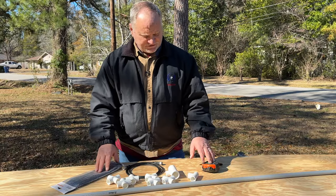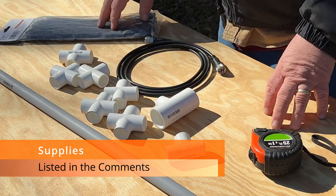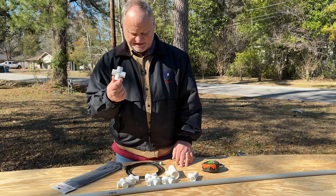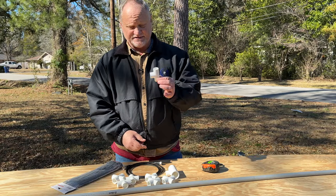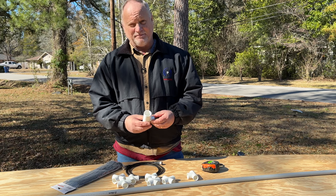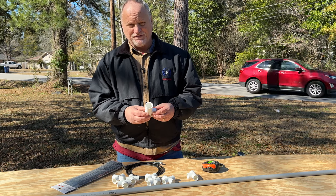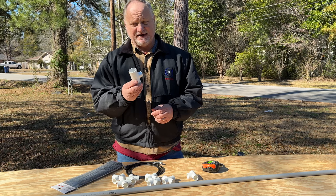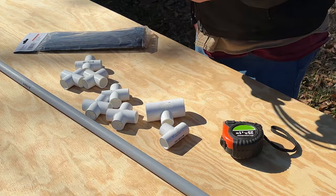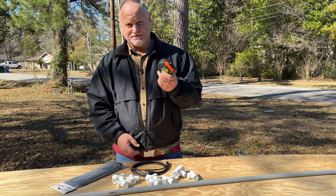Here's all you're going to need. From the hardware store we got a 10-foot stick of half inch PVC pipe — you could use grey or regular PVC, it doesn't matter. You'll need six half-inch cross pieces since it's a seven element antenna, plus a T-piece for the very front director and the back mounting bracket. I'm mounting this on a mast in the attic as a permanent solution. You'll also need a piece of coax cable to wire up the antenna, and last but not least, a tape measure. Let's go cut some pipe.